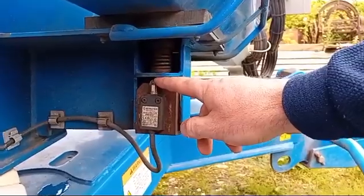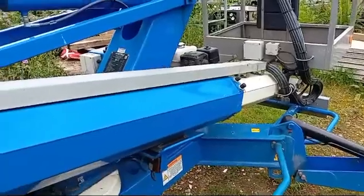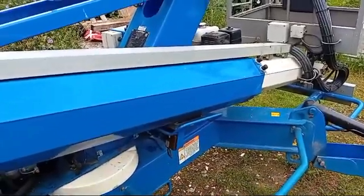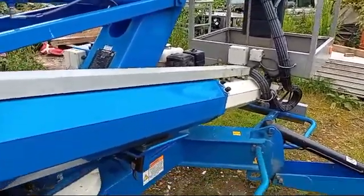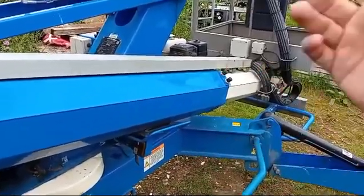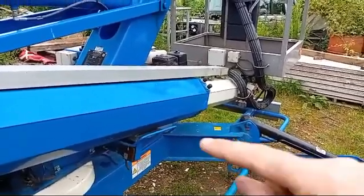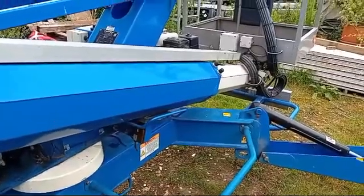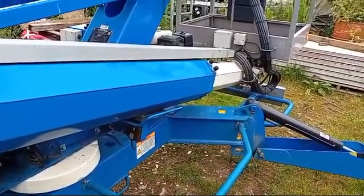More often than not there's no fault at all with the machine — it's just that the boom hasn't been fully lowered onto the pad to release that switch. That'll save you a bit of head scratching when you're wondering why it won't work. Nothing wrong with it at all, it just needs to be stowed properly. What very often happens, especially if there are two of you in the basket, is you'll come down and think it's on the boom rest — which it more or less is. But when you get out and 200 kilos leaves the basket, there's a little bit of hydraulic oil pressure in the ram still, and the boom just jumps up by a couple of inches. The machine then thinks it's up in the air and it won't work. So bring the boom down fully using the ground controls and problem solved.